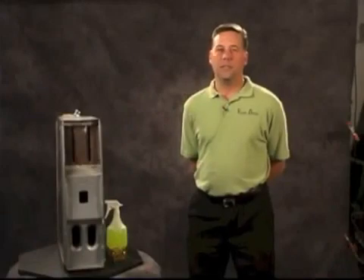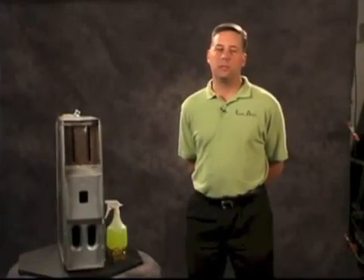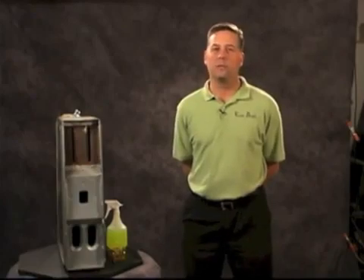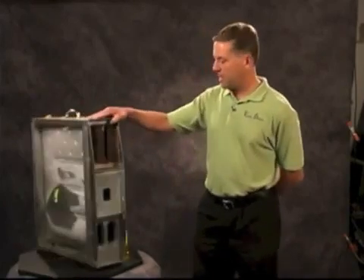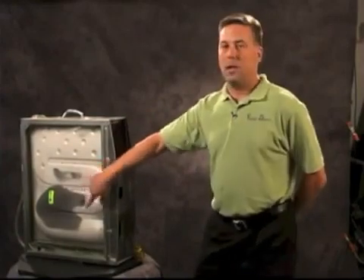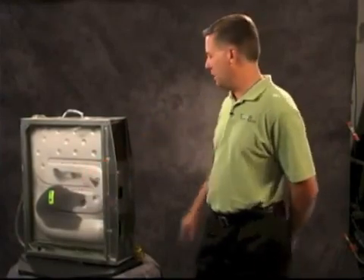I'd like to demonstrate how to use our product. Most heat exchangers have very limited access. If the crack is where you can't view it — either from the A-coil access, through the blower, or through the insertion limit hole — you have no way of finding any cracks that might otherwise be visible. The Visible Defects Visual Detection System is especially useful on heat exchangers where portions are not visible for inspection. Serpentine types of heat exchangers, due to their shape, after you get through the first pass, you cannot do any inspections.